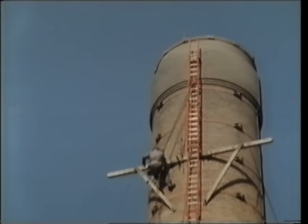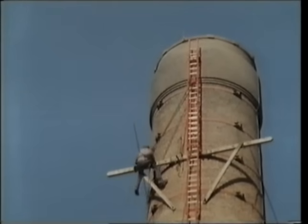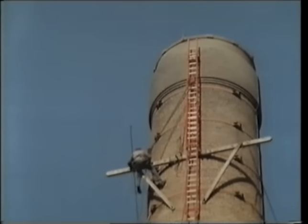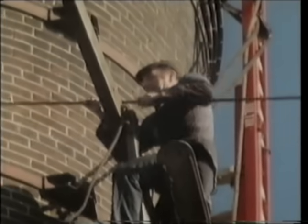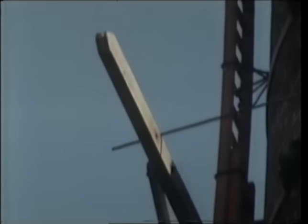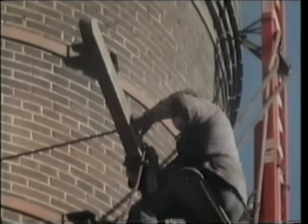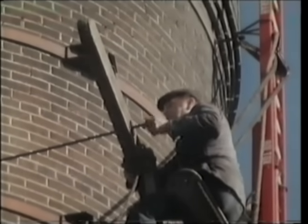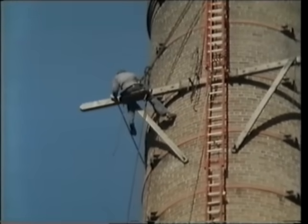All the modern men use aluminium scaffolding tubing now, but I like this way of doing it. It's a bit more awkward, but when you've got it all up, it's quite solid. When you've finally got the rods through the two sets of holes, then you put the washers and the nuts on, or a few packing pieces, so you can slightly cramp them up round the chimney.